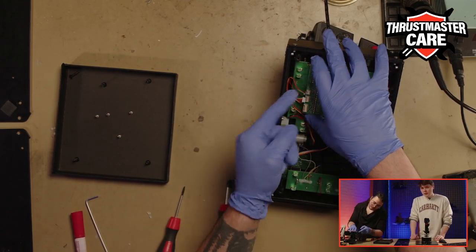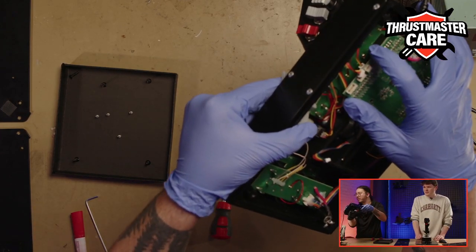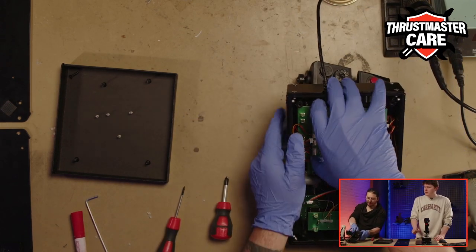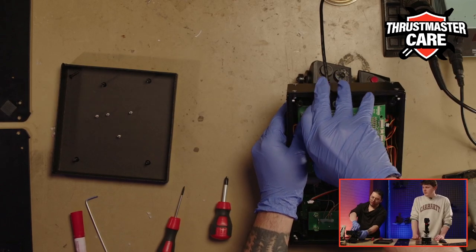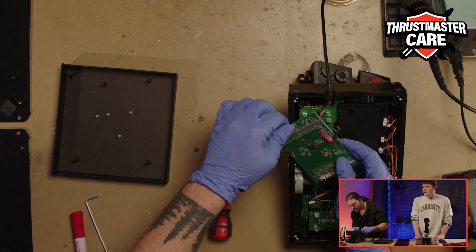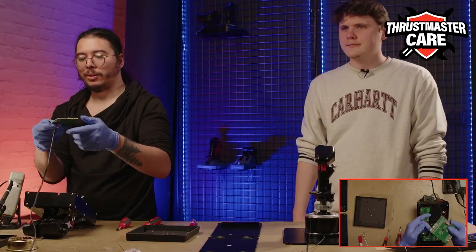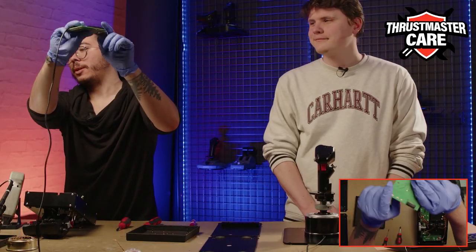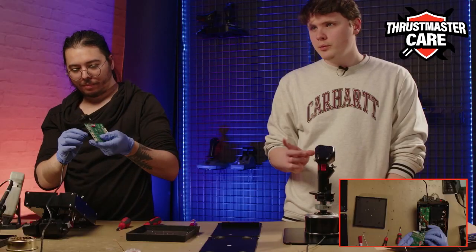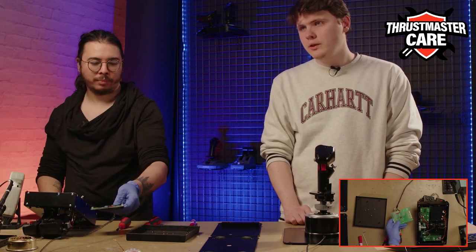It will be really important to be careful of this plug. I can show it. Just there, you see this black socket here? There is a lot of little pins on it, so just remove it slowly. Yeah, perfect. There we go. You just need to take it off. It's important to be soft, because if you break a pin, you need to send back your product.